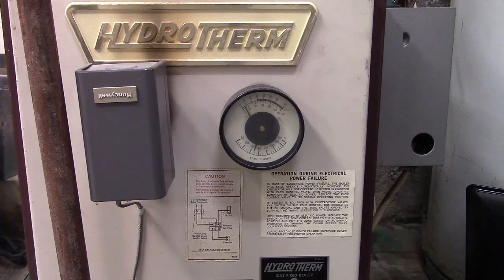Might be getting a little warm, so I'll move it from where it was. The numbers have risen drastically, which is interesting. A lot of CO2 now, 1,600 and 100 and... No, it's going down now. It was up to like 100 and something carbon monoxide. Even 200 now. But again, there's no backdraft. CO has calmed down to 19.